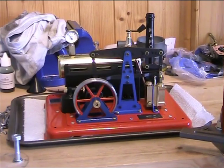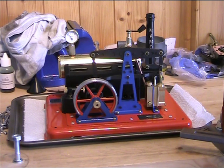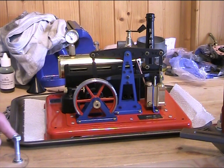I've just noticed the pressure gauge is starting to move now, with the safety valve just starting to lift, as it were, and it's showing about 7 or 8. Well, I presume that's pounds per square inch. It's lifting now, perhaps just slow to react. Now I thought these were set for, was it 40 psi? With a 20 psi option safety valve. I didn't request either, I just picked one off the shelf as it were in this factory. Anyway, we've gone up to 10 now, so that's just slow to get. Excuse me, so we'll give it a whirl.